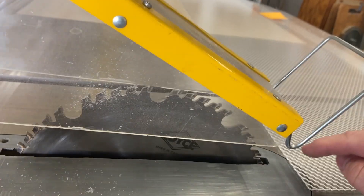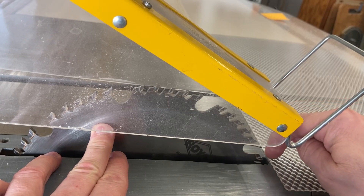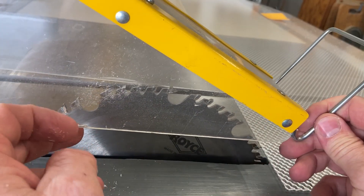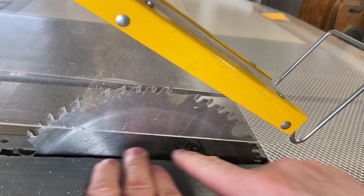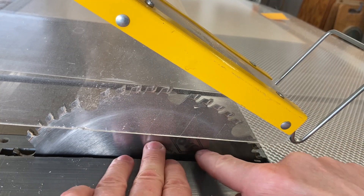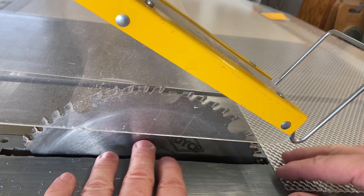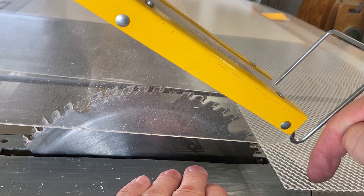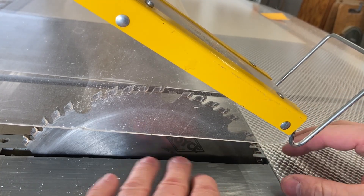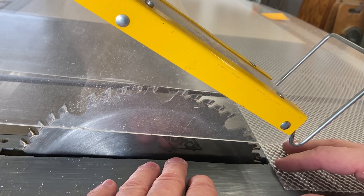Important thing number two is that the blade on the table saw is set to maximum depth of cut. The reason for this is that the rotating saw blade hits the material as close to vertically as possible. The force along the saw teeth is perpendicular to the radius, so at the 12 o'clock position it is horizontal. I try to raise the saw blade up as close to the 3 o'clock position as possible, because at the 3 o'clock position the force exerted on the material being cut is exactly vertical — right now it's at about the 2 o'clock position.